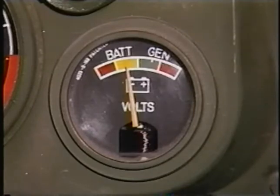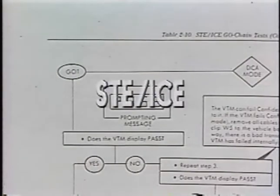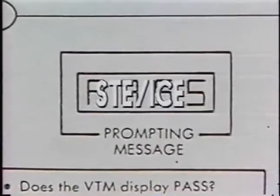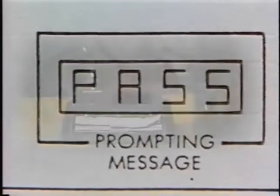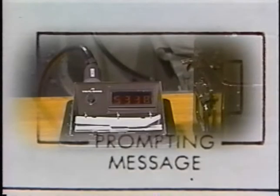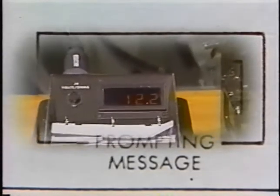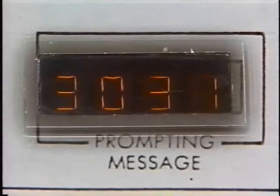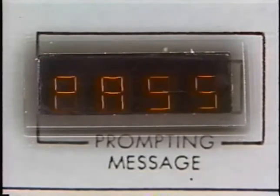But now there is another kind of problem. The battery gauge keeps going into the yellow range. Troubleshoot the charging system using Simplified Test Equipment Internal Combustion Engine, known as STIICE. Follow the go-chain test for the STIICE found in the technical manual. First, you must power up and run the confidence test for the VTM, or vehicle test meter, to ensure that it is good.